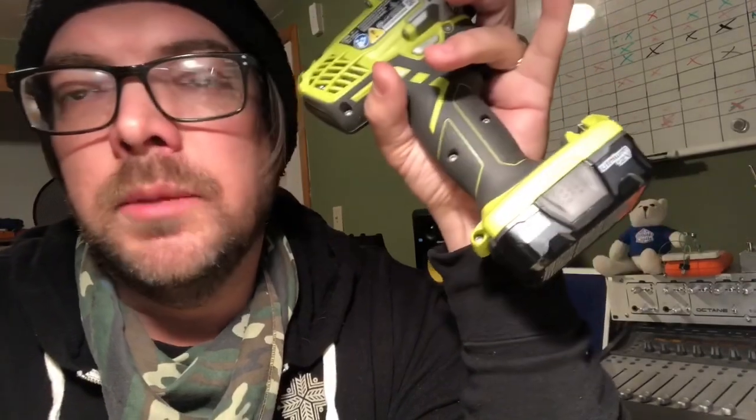The solder sucker is really good for when you make a mistake. You can easily fix it. I like to use a little dentist tool or a pocket knife. It can be good for poking around and moving things and bending things. You're going to need a drill to drill the holes in your enclosure for your jacks, your switch, and your potentiometer. I would recommend a stepped drill bit. They're kind of cool because you can just keep going down and they'll drill to the size you need.